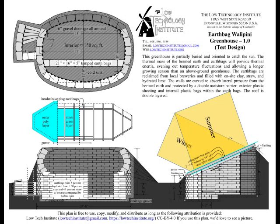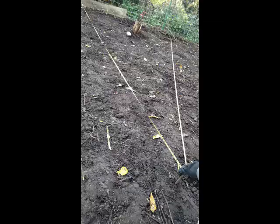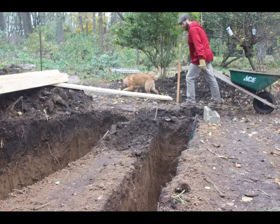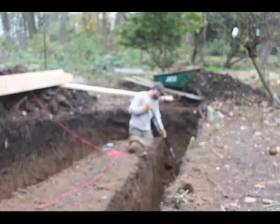We started this project in 2017 by laying out where we wanted to build this, and we put it behind our garage. We had to clear off the topsoil and the overburden because we didn't want organic material in the backfill. We laid out the corners using triangulation to get it square and then started digging our trenches. We did it all by hand, and it took quite a long time. I was able to move about six tons of earth a day, moving the organic topsoil into garden beds to get to the clay underneath.